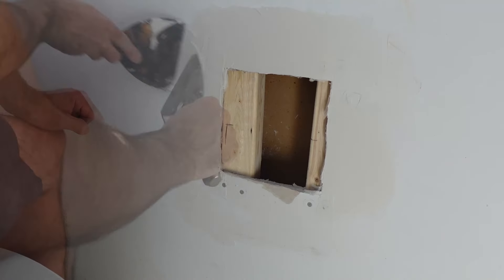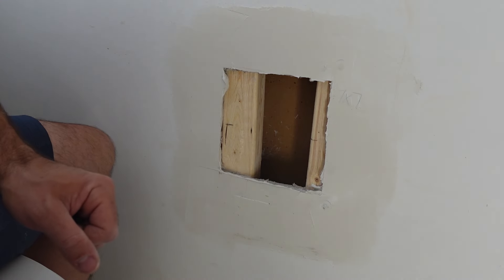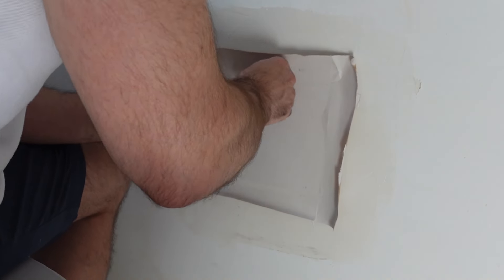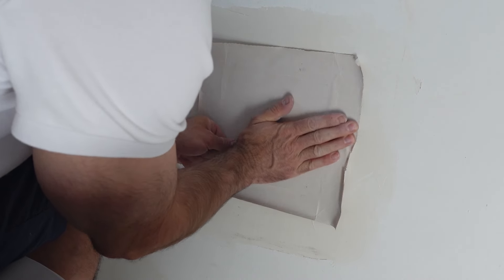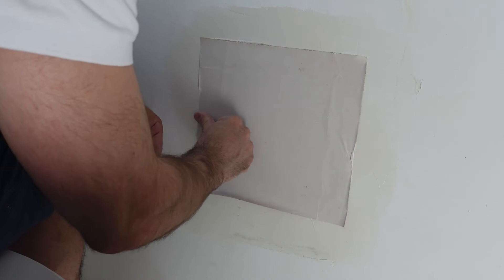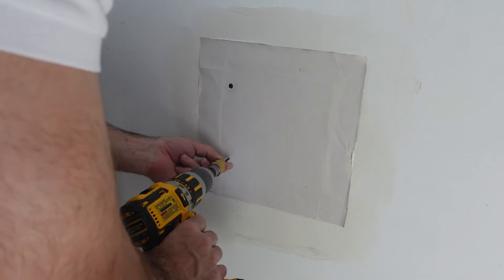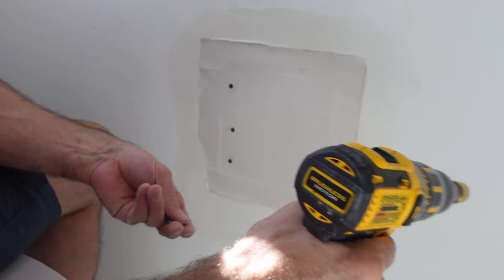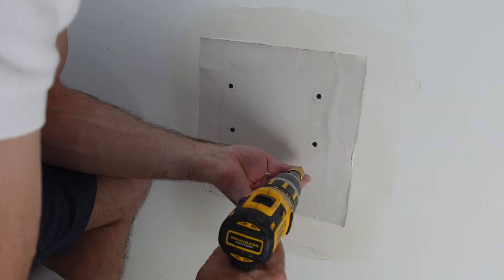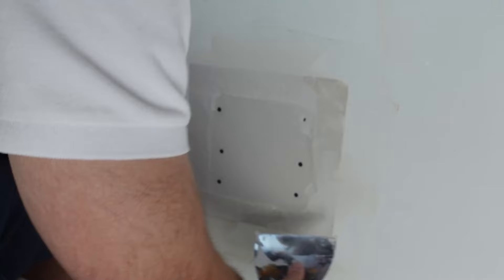Once I'm happy I've got 360 degrees on the hole, I'm going to take my patch, insert it into the hole, press it in and make sure it's flat all the way around. Then I'm going to start working the face paper down into that drywall compound. Before smoothing it out with the putty knife, I'm going to take six drywall screws — you could use four, it doesn't really matter — and secure the drywall patch to the two by threes. I'll take the screwdriver and make sure those drywall screws are perfectly seated so they don't cause problems when sanding later.